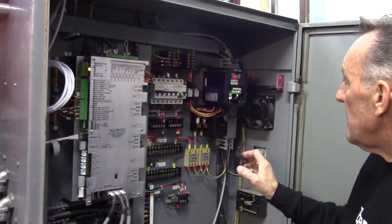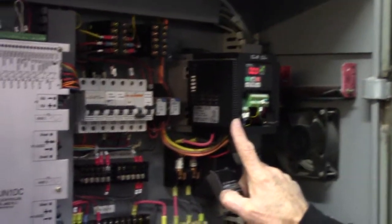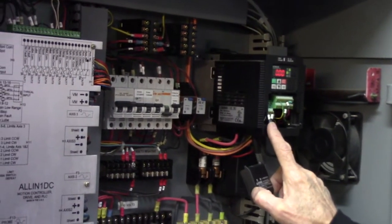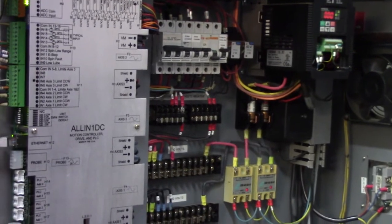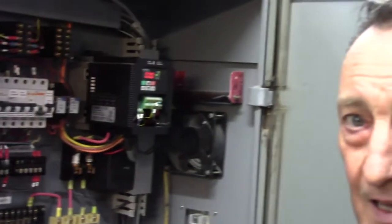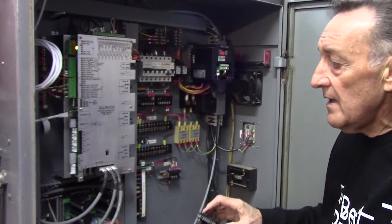That's your VFD for your spindle right there, right? Yeah, this is the VFD for the spindle. This is 2 horsepower, so it runs that VFD up on top there, and it controls the speed on the G-code program. Runs really well. Turned on by two solid-state relays. So there are some things that I did here that are a little bit overkill, but I'm pretty proud of my wiring, and it works really well. I've not had one iota of trouble with my wiring.